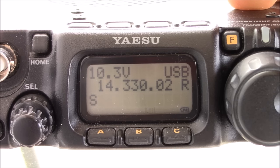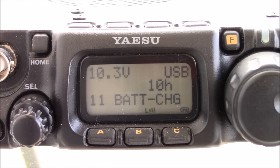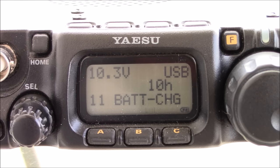A lot of it is menu-driven — there's a lot of stuff in the menu if you hold the function button. The radio does not have a charging circuit built in. Depending on the battery's milliamp-hour rating, you set it for a 6, 8, or 10-hour charge. Without a built-in charging circuit, it would otherwise just charge constantly until the battery gave up. With a high-capacity battery pack, set it to 10-hour charge and you'll see a timer showing how long it's been charging.